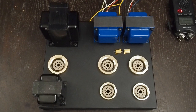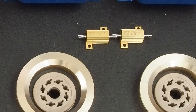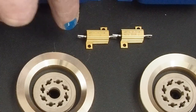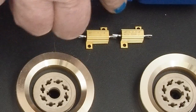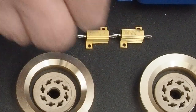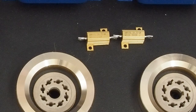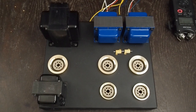So we're going to mount them up here on the top of the chassis, right behind the two power tubes. The center will be the common negative, and then each end will go to the cathode of each of the EL34s. We'll drill holes with a grommet to run the wire through. These are actually a lot smaller even though they're rated at 10 watts — a lot smaller than the previous ones I used that were some eBay specials. Get them bolted down with some heat sink compound and they'll be fine out here where they can get some air.